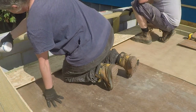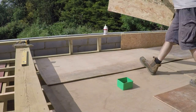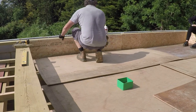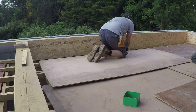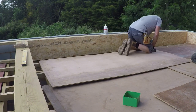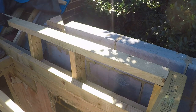With that done it's on to panelling out the sides of the upstand parapet. We're using 9mm OSB — this gets glued on and screwed in place all the way around the outside to give it the upstand. And there you can see we've got the identical heights of the two walls, which will get a bit of 18mm across the top of it, which will end up having the capping on just to waterproof it.